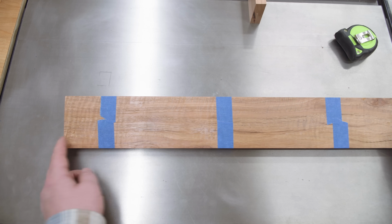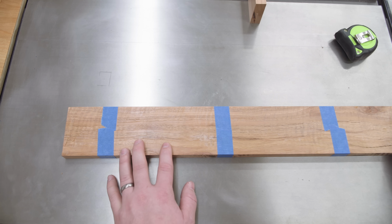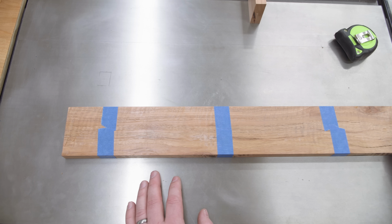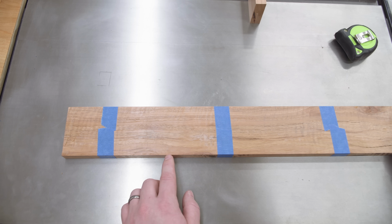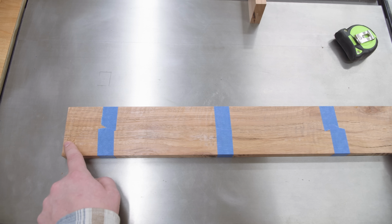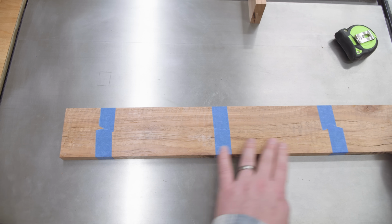And also, I don't need all of this board. I need to cut it to its final length, which is one short side plus one long side, and I'm thinking 11.5 inches should be fine, even with the curve cuts. So I need to avoid this chunk of tear out that I made last night, or yesterday here in the shop, and that's pretty much it on this side.